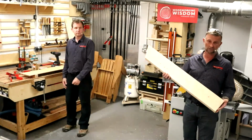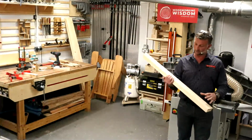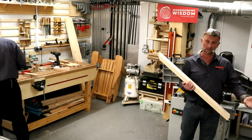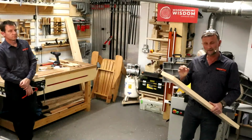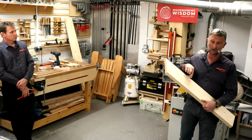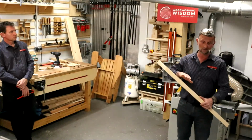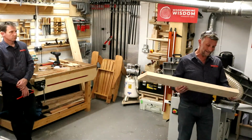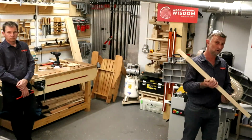Yeah, that's great. So what Jason in effect has done is pinned those two components together. They need to be an identical shape and size. So pinning them together, machining them, planing them, and cleaning them up after the bandsaw ensures everything is spot on. And these aren't just random screw holes he's put in there. They're going to be screw holes or fixing points anyway, so we're not damaging our lovely chair. So what we need to do now is take this over to the bandsaw and cut it out. So follow me on over.